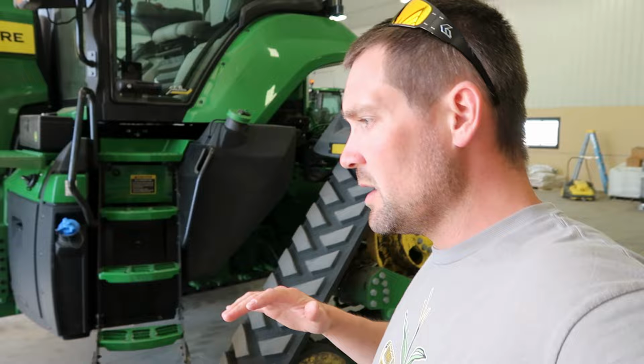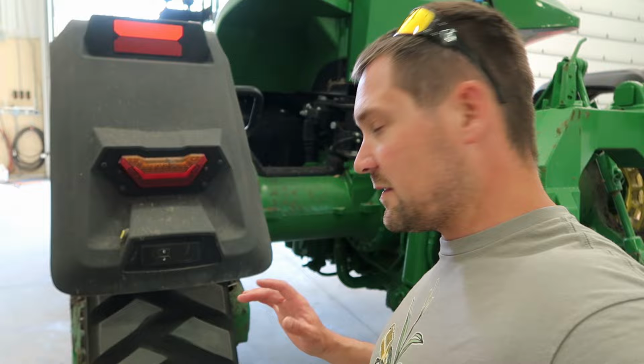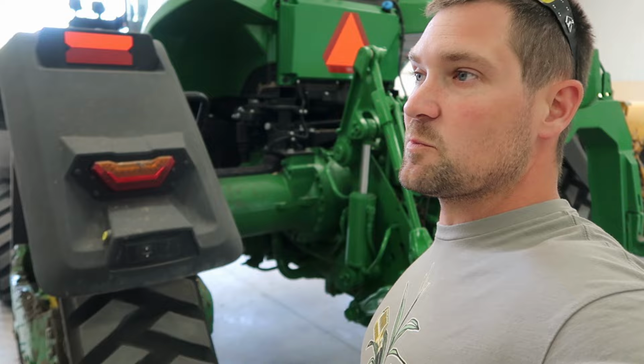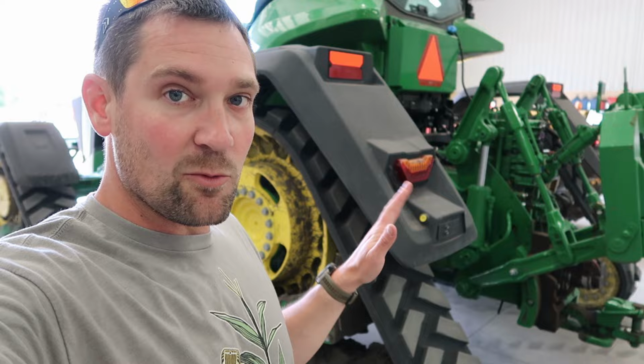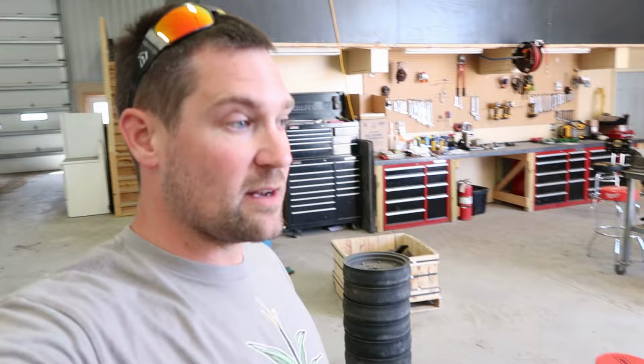These belts, more so in the back than in the front, this is gonna be my number one complaint. And the Deere guys already know where I'm going with this. But I gotta bring it up. These belts, between 6 and 8 miles per hour while pulling the planter, you'd get a little bit of a shudder. It was almost like a harmonic vibration in the belts. And you could see these belts shuddering a little bit. At 8 miles per hour, while planting, that would completely go away and the thing was smooth as glass. But between 6 and 8, there was a point in there where those things would just dance a little bit and it was enough to be annoying. I know that they're aware of it. I know that it's a thing, so I would assume they're gonna do something about that.